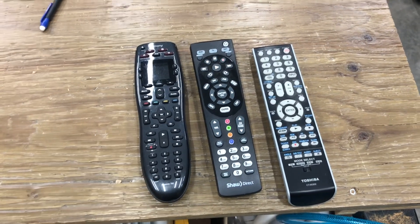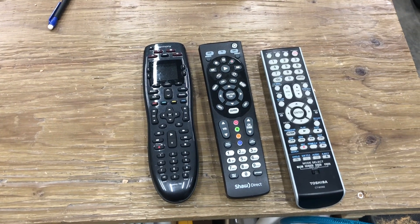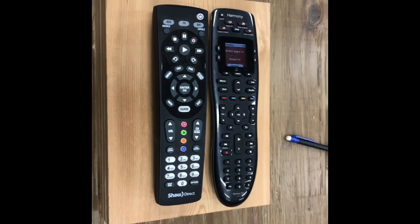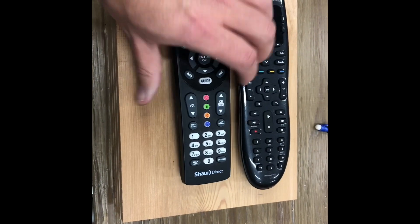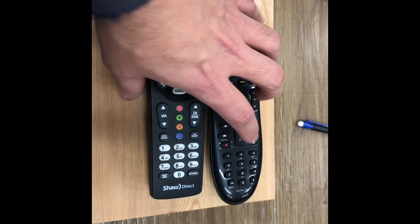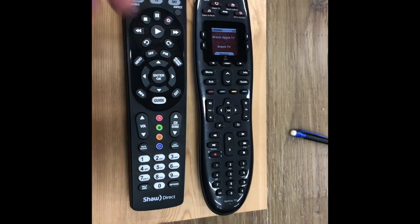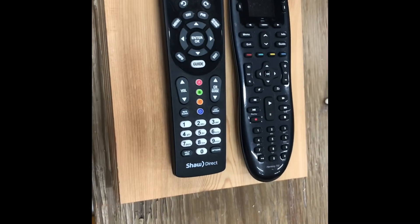I'm just trying to get some sizing figured out, get some wood cut, and then I'll kind of go through what I'm going to design and how I'm going to do it as we move along. I got the tops and bottoms milled. The bottoms will have the bigger knots and defects, the tops will have the ones with less. I'm just going to rip these down so two fit in fairly easily. I've also got to figure out how to get a hand in there, so I'm going to leave a little space so I can move things around and get my fingers in there. I'll mill off maybe an inch or so of this.